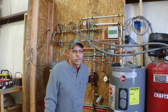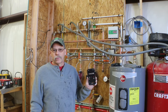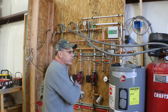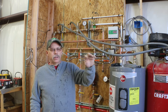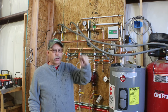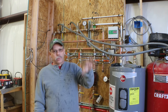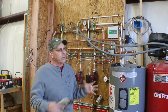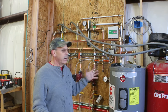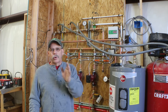Well, we're currently at about 17 minutes and 45 seconds on this first loop. But again, I had to get all the air out of this, and I'm finally starting to see that the air bubbles are just starting to trickle out at the top of that bucket. I'm gonna let it run for another couple, 3 minutes, watch it, probably get 20 minutes total on this first circuit. And then I think we will have purged the majority of the air out of the system. So I think the other loops will go much quicker.